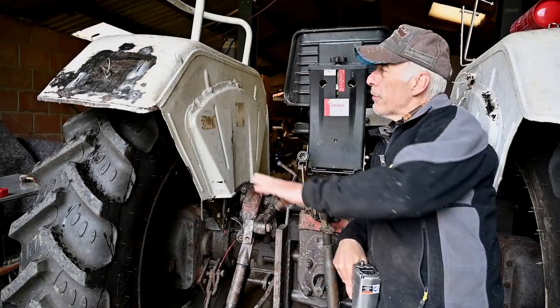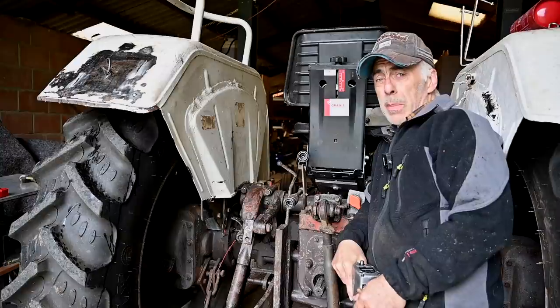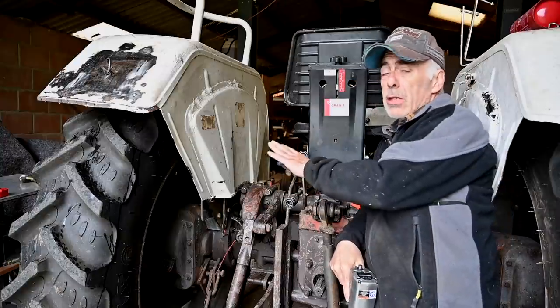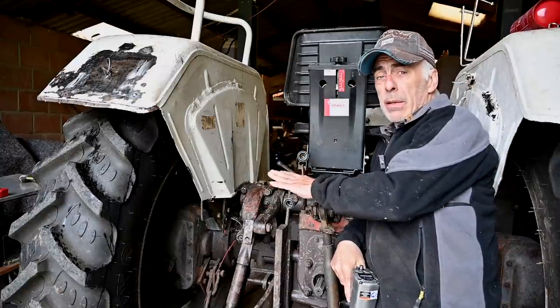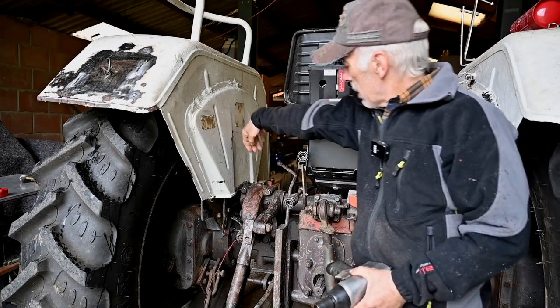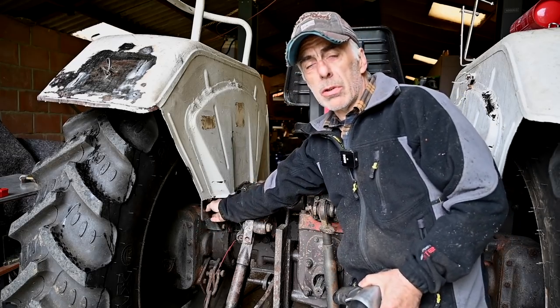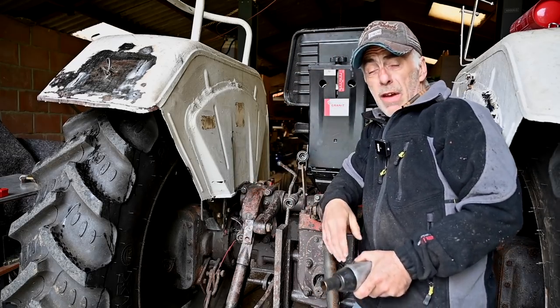So I'm going to take the fender off so I can blast it. To take the fender off, you need to remove about 5 bolts. Now, these are the square fenders. They are mounted differently than the half fenders, as you see. The bolts are actually over there. There are 2 bolts there, and about 3 bolts underneath you need to undo. And they can be very tough to get out.